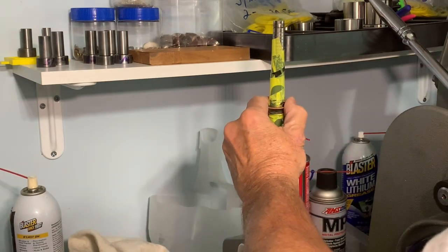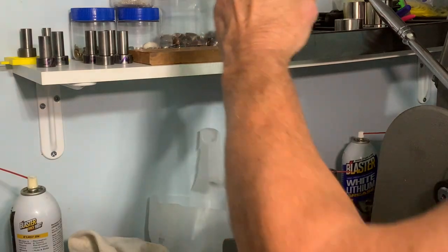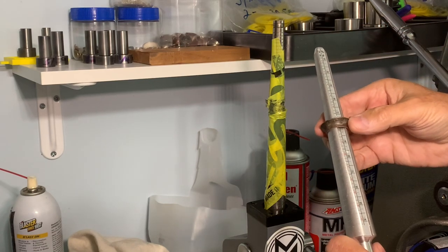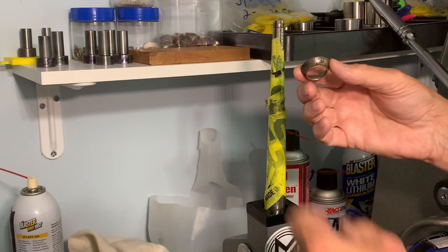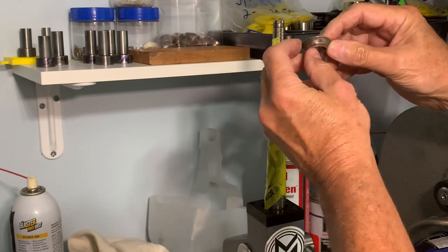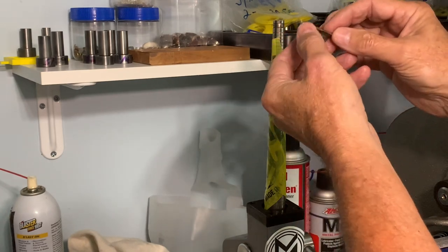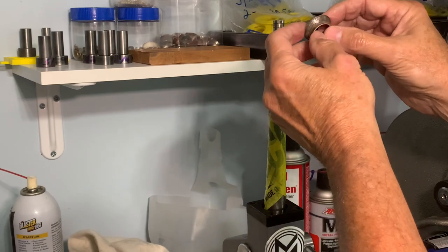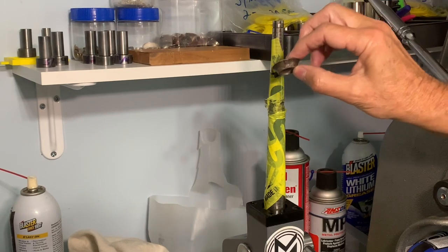If I feel it getting work hardened, I'll stop and anneal again before I get it to 13 and a half. Let's stop right here and see where we're at. We've gone from five and a half to an eight. I'll check it under the magnifier and make sure there's no tears. Nice and easy. I'm going to go ahead and continue to get it to size 13 and a half — maybe 14, but 13 and a half is probably where I want to go.